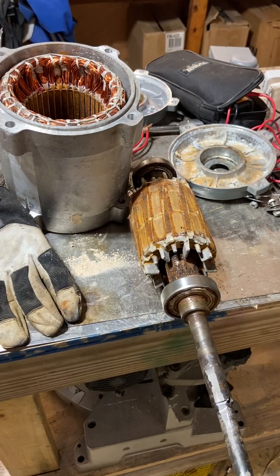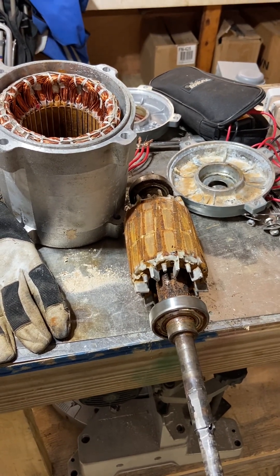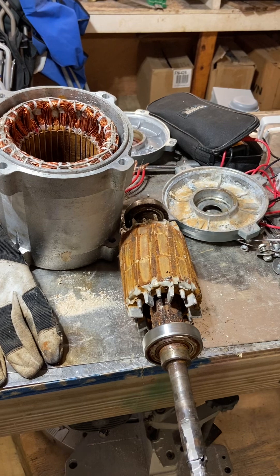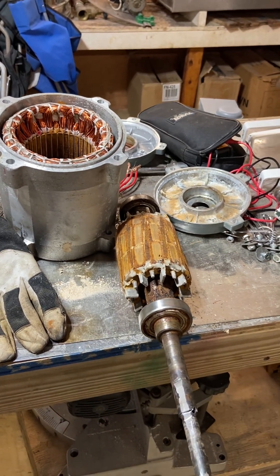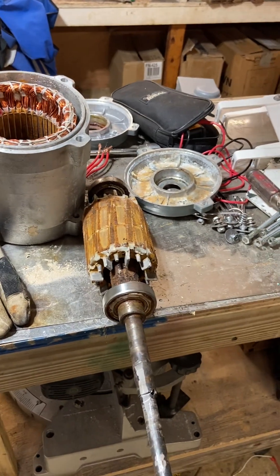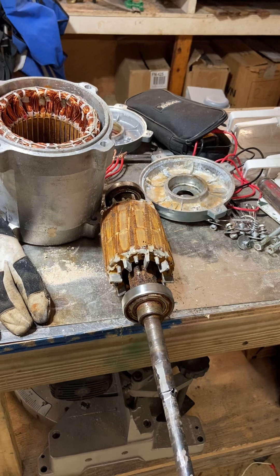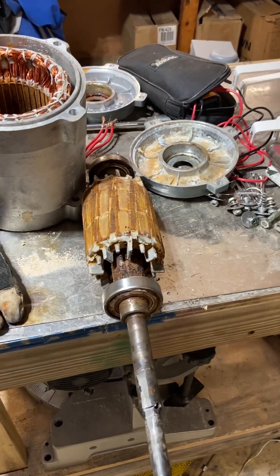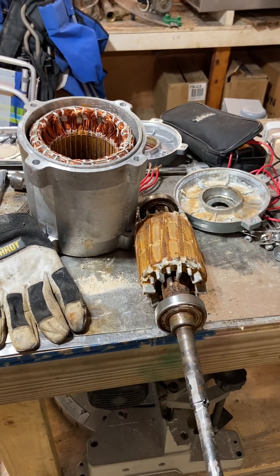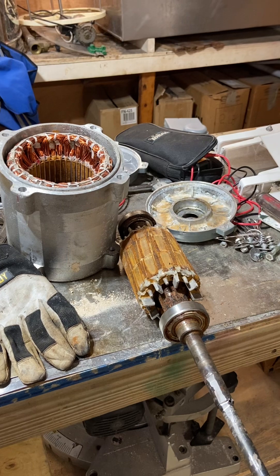It took 35 mile-an-hour winds just to get the thing to spin. Then some rep at Tesup tells me to take out a few blades — I'm not doing modifications. But I did do modifications because it's the only way to make the thing work. I took down to six blades doubled in size, brought startup speed from 35 to 18 mph, then down to 12 or 13 with three double blades. I told them something's wrong with the generator — send me a smaller one. Tesup refused, so we'll see what the lawyers say.